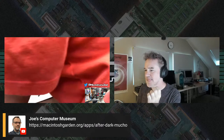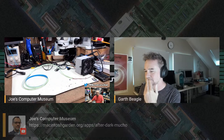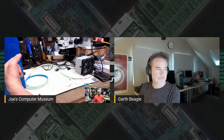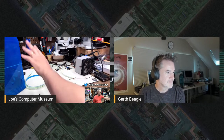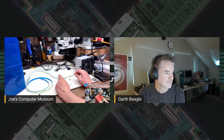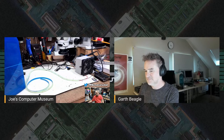So we get to cut these into their sections and then create the links between them, right? The reason we need to do that is that trying to get these all hot glued in place in here, then solder them after the fact while it's inside here, is bad mojo. You don't want hot metal near nice clear plastic. So you want to pre-snip these and get them stuck to the side, and then you can clip off the pieces of the wires for the links that you need. So let's do that.